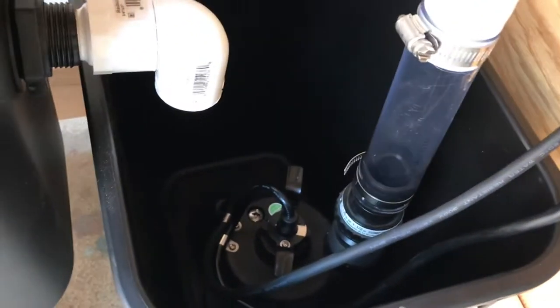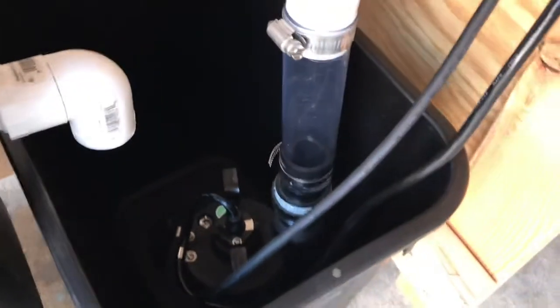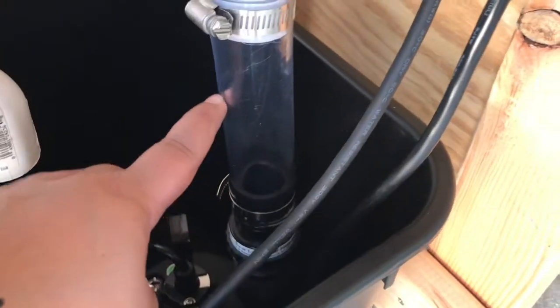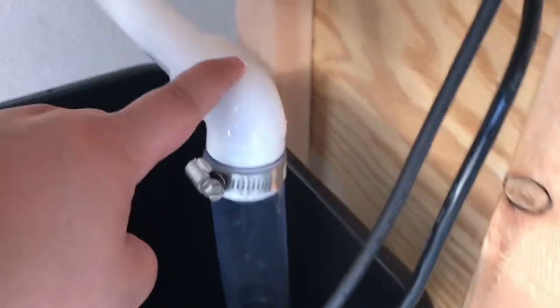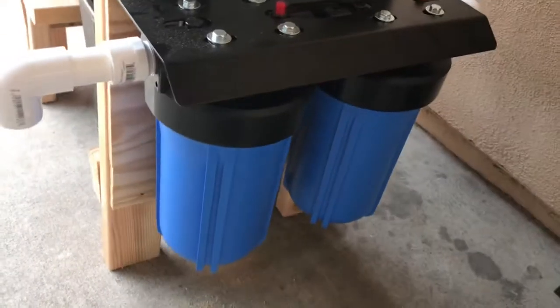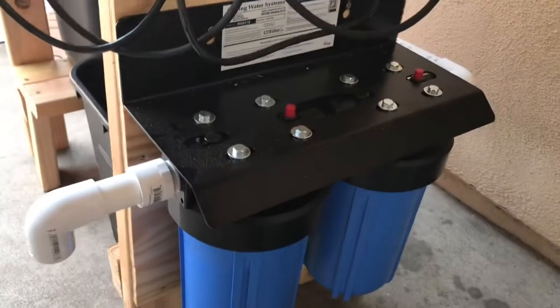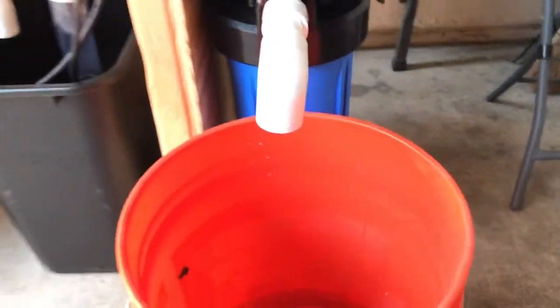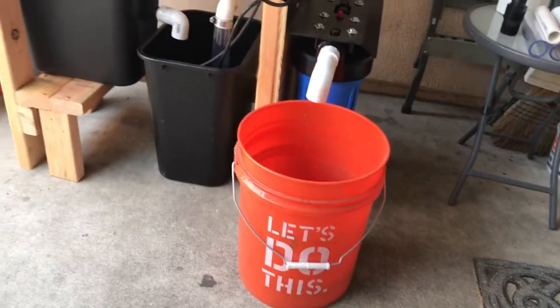In this one there's a small sump pump with a float switch, so once it kicks on it'll start pumping the water. I did put a check valve on, with a little piece of clear tubing, and then it goes down this way, around, through the back, and on to my two-stage whole house filter. Because I'm on a patio I had to get creative — it pours out through here and down into clean buckets so I can safely discard it.